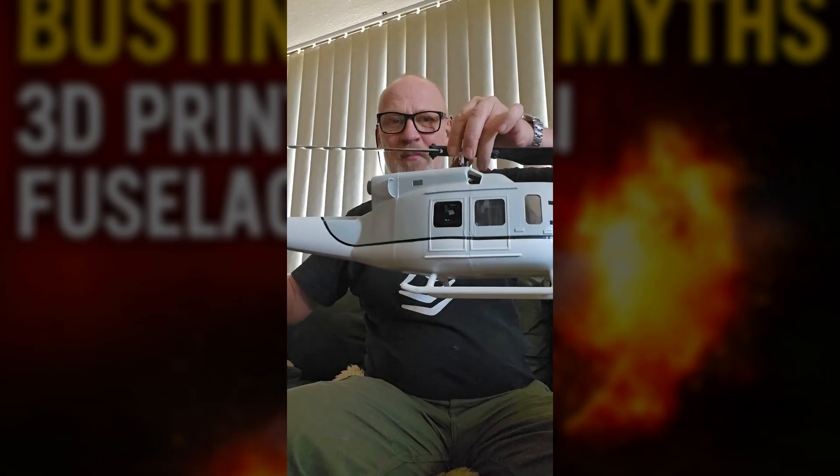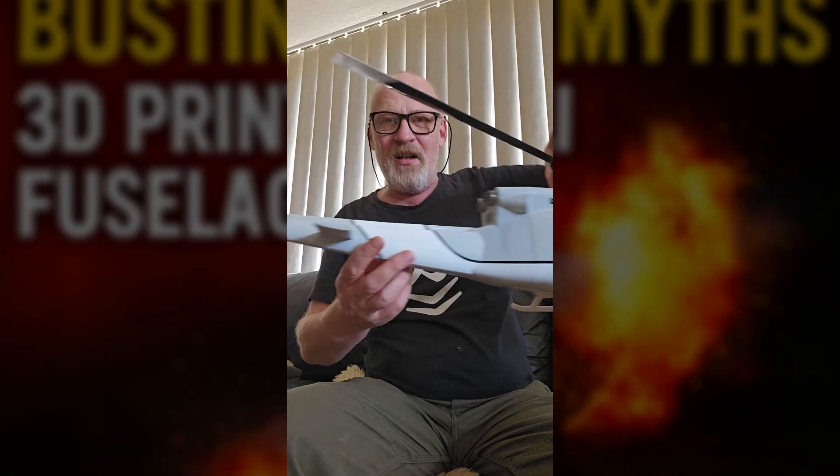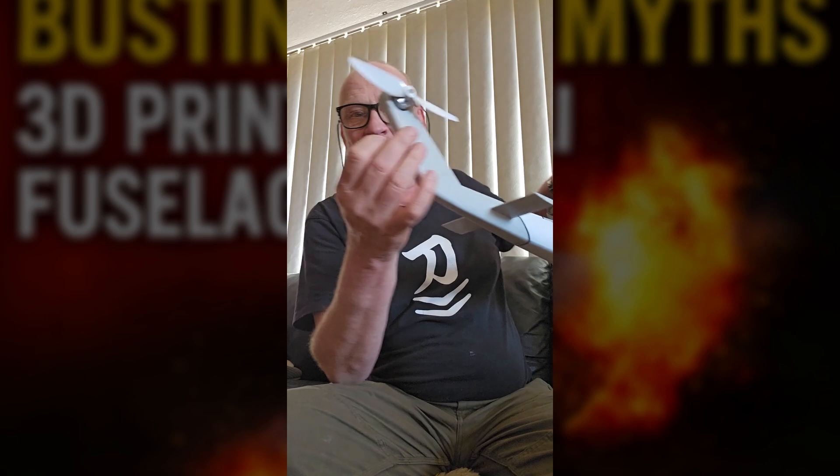Here's a fully loaded 3D printed helicopter, and I'm going to pick it up in a very unnatural position. The battery's in, everything's in, there is a glue joint here. What I am trying to demonstrate is the helicopter balances on the shaft — the only force this actually needs to exert is to push the tail. I can actually blow on it — that's how little force this actually exerts. When I put it on the table and I try and twist it, there's no lattice in here or anything, it's just a couple of these straight to the fuselage. I'm trying to twist it and there's literally no movement. When I do that to an original fiberglass fuselage, I can actually flex it. So to those that are saying this is not strong enough...